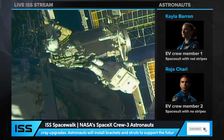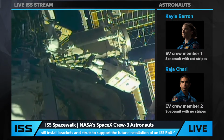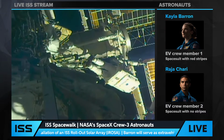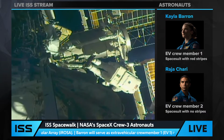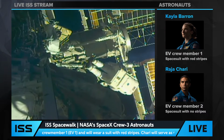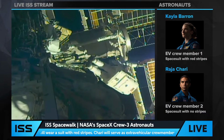Take a breather, and you can leave the short PGT and the torque wrench on the right lower strut handrail. And when you're ready, verify that MLI covering the lower strut pad. Roger, I've got PGT settings for you when you're ready. Bravo 7 clockwise 2, if that's still good. That is a good readback. You can drive M20 to torque, looking for a minimum of five more turns. The M20 to torque, looking for five turns.